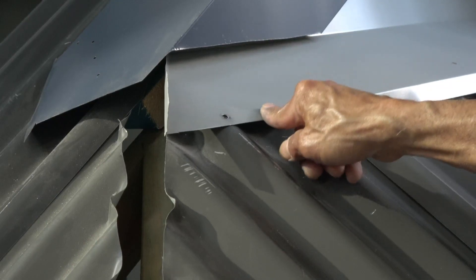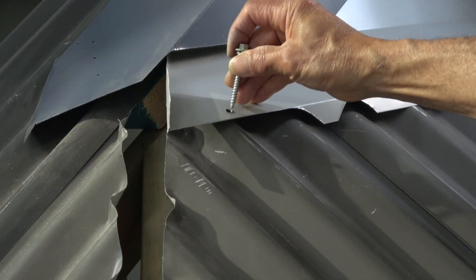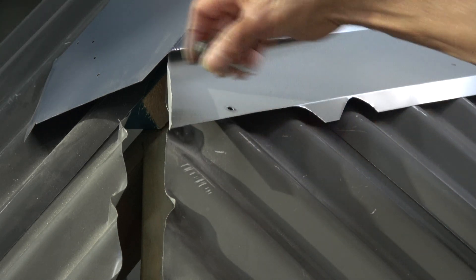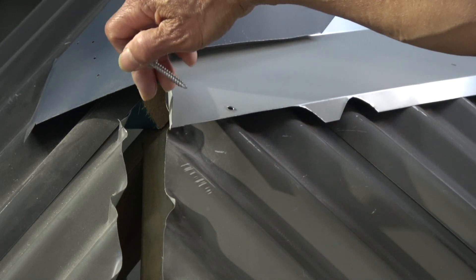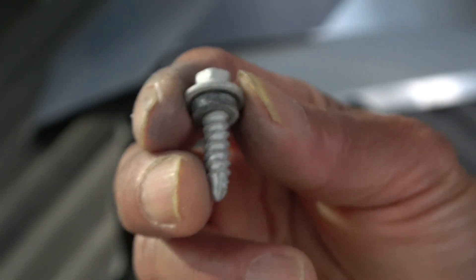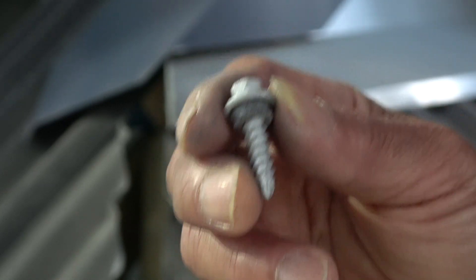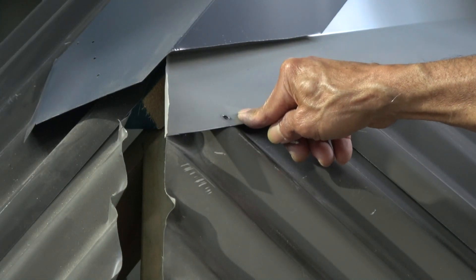The threads will actually guide the water into the roof. If you wanted to use this type of screw, you would make sure there's a batten underneath so it actually holds — and that will work. But if there's nothing underneath, you've got a problem. Normally you don't intend to put a batten underneath for most flashings, so this is where the 25mm screw comes in. This is the correct screw to use whenever you've got a flashing screwed through a roof with no batten underneath.